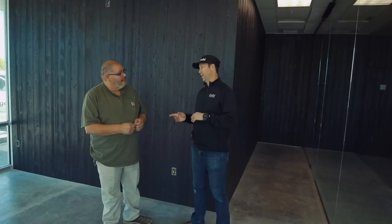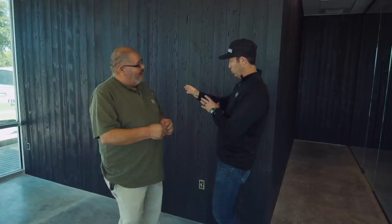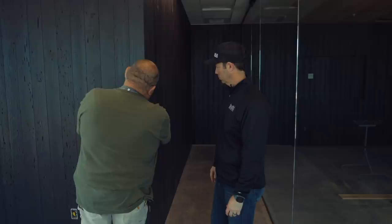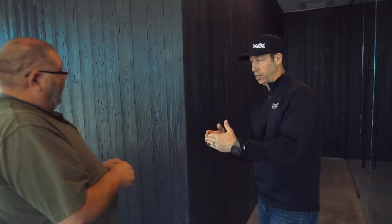Gilbert, this is some spectacular carpentry — very, very crisp. Talk to me about this wood wall: I'm noticing you've got full board on that end and full boards on the corner. Did that just happen to work out? It just happened to work out. My whole thing was I wanted this corner to look even on both sides, so we started with that corner first. Now talk to me about this miter — that is one really nice miter. How do you get it so crisp? I like to run these at 46 degrees so that the front part meets before the back part does. So when you run it on the table saw, you're setting the saw one extra degree.